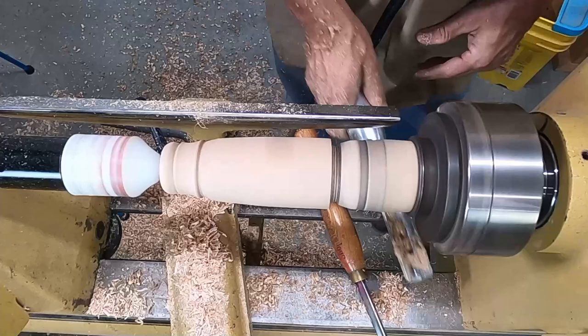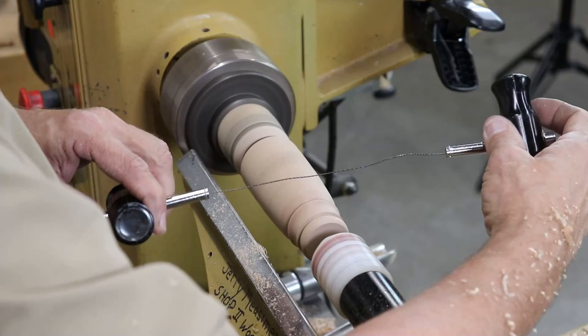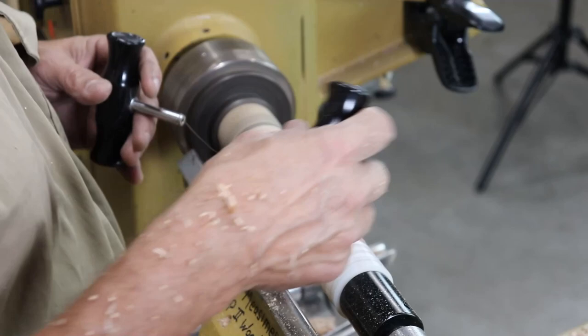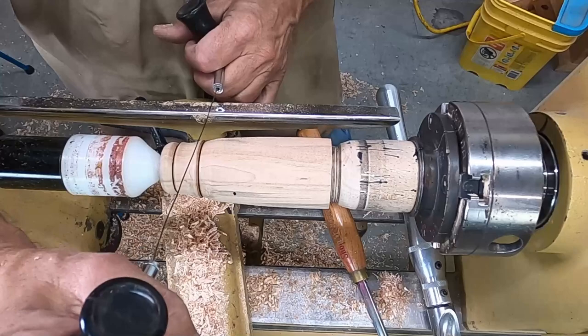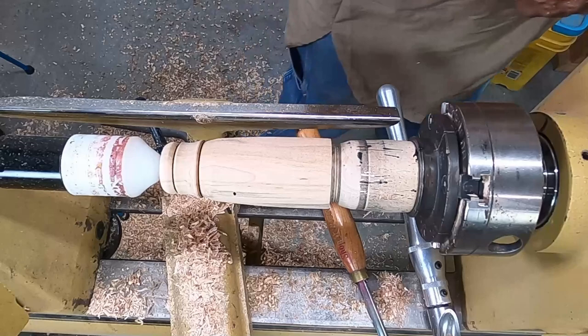I also like to use a burning wire. This is actually wire that cuts out windshields — these are the handles — but you can get burning wire or guitar wire and just place it on there and let it burn. When I use the wire it's not like I'm just dangling it there — remember this is rotating. I hold my forearm on the lathe, my other arm tucked in, and burn it like that. You have to be real careful when burning; you just can't stick it in there.